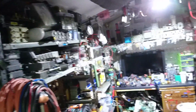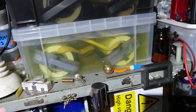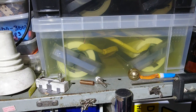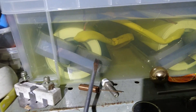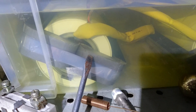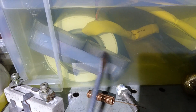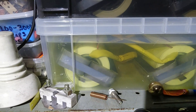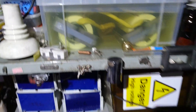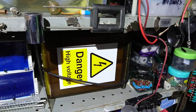Have a little look around the place. Yeah, these are the transformers I got out of that unit — 150kV each, high frequency, absolutely beautiful. If you notice, you see the iron core on these — you'd think that being iron core at high frequency you'd get saturation, but the plates on these are so tightly squeezed together it enables it to work, which I find awesome. So no need for ferrites — that's a big beast capacitor as well, 150kV, some serious high voltage.